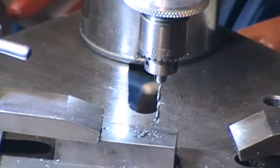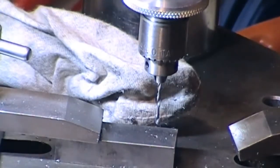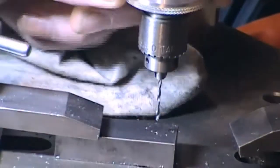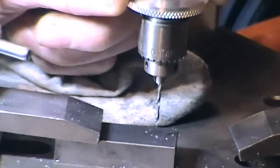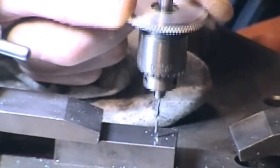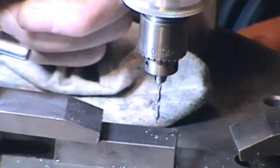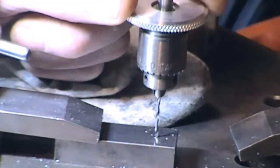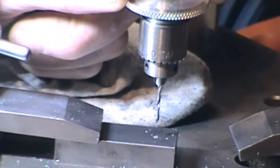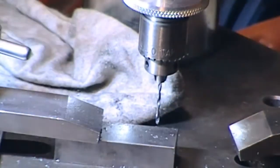That's all I'm doing, just to give some idea on it. The control of pressure on here is very critical but useful — much less pressure than you'd get using the ordinary drill press feed. You can actually, in a sense, go by the seat of the pants, so you can actually feel what cut is safe and what isn't.